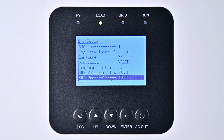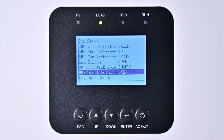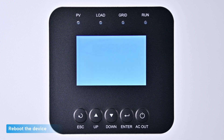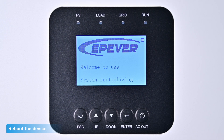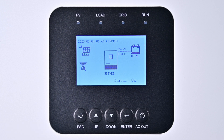Under this item, we can also enable both BMS voltage control and BMS current selection simultaneously. Reboot the device after configuring the settings. The BMS icon will appear on the screen, confirming the device and battery are successfully communicating, allowing you to adjust other battery settings.